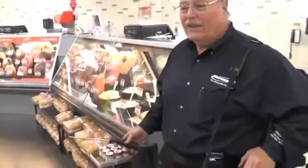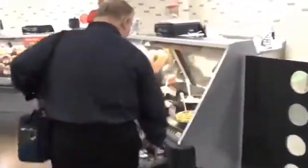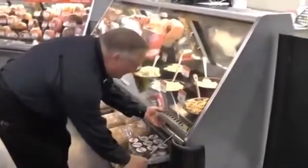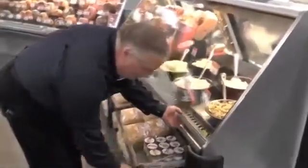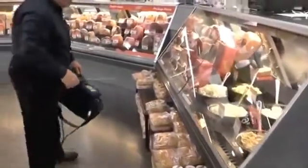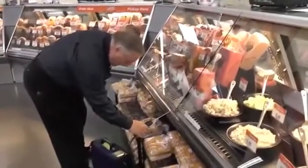More leaks occur in these meat cases than anywhere else in stores, in my experience, and it's a very simple and easy way to check these. Essentially what I do is set this down, flip the front edge a little bit, and let it get a good whiff inside that case. If there's any leak at all, it's going to be a dispersion inside these cases, and you'll find it very quickly this way.